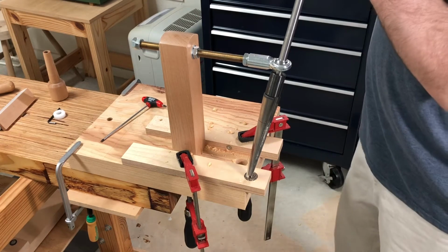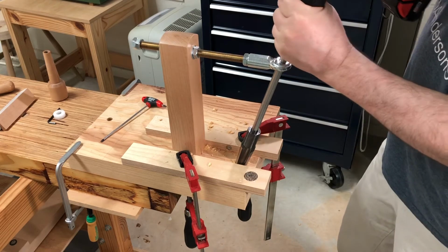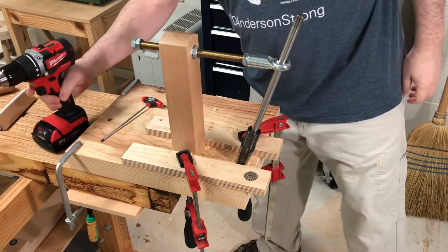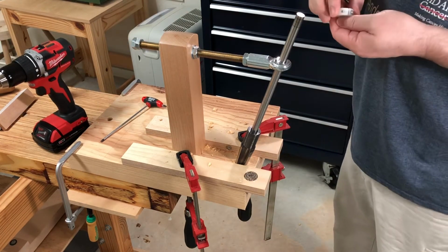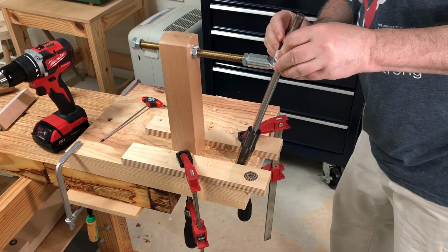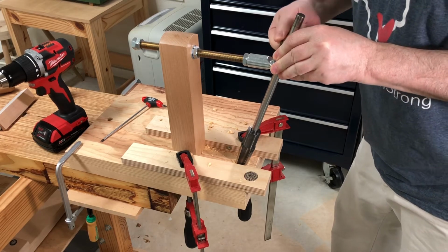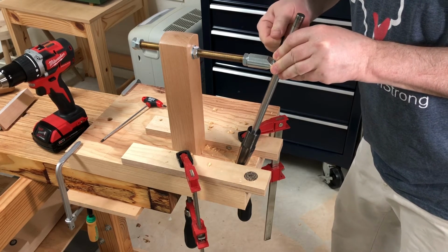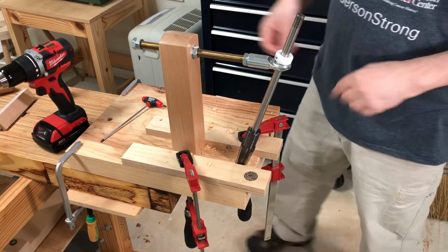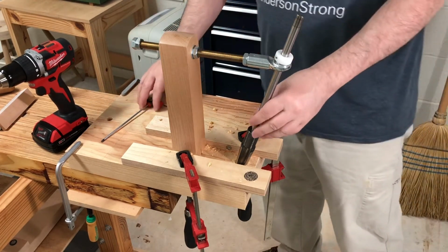So we will go ahead and put the tapered jig back into the mortise so that it's at that depth. And then we can use this depth stop I told you about to actually put on there and get that secure. Now this is kind of like insurance, so that when you're drilling two leg mortises, usually they're at the same degree angle. So this will give you some opportunities to not only make sure that you're at the same depth for each of those leg mortises.